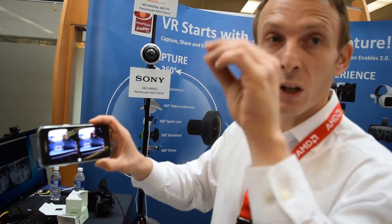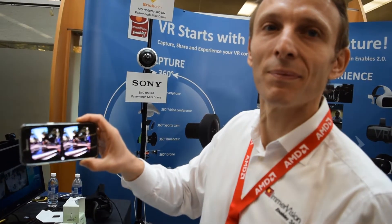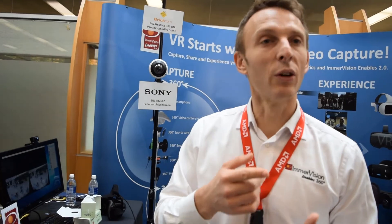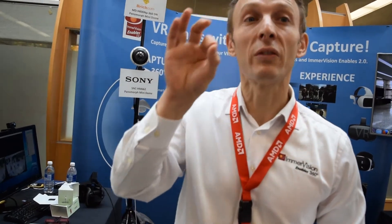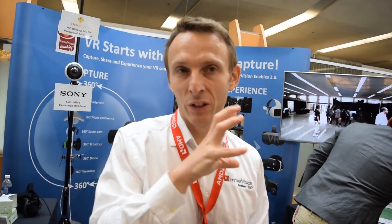After the fact, using the QR code and the marks inside the image, the player stabilizes the field of view. The QR code contains G-sensor, GPS, and accelerometer information, plus the type of lens — because each lens is different and requires specific processing. The lens from the action cam and the broadcast lens all have different algorithms. Device manufacturers can also add the type of device, usage data, and camera trigger events.